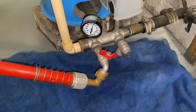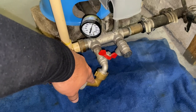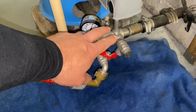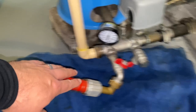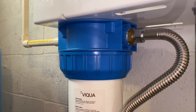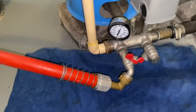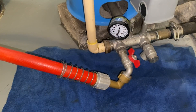So we've got our hose hooked up. The best place to do it is on the tank T-assembly itself, right here. This hose bib is designed to drain the tank as well as do other things like chlorination, yield checks, etc. We're going to hook up here because we'll get the highest flow and the highest draw from the tank. We want to make sure we're avoiding the filters while draining, and you want to go at the lowest point on the tank so you can make sure you get all of the water out.